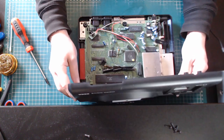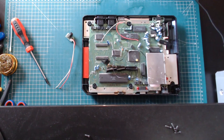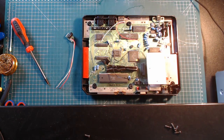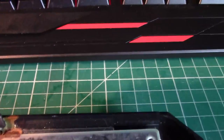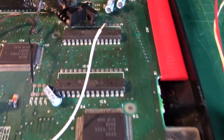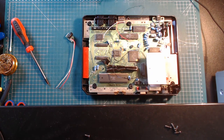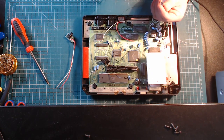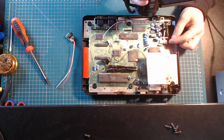Oh dear god. What are these? Let's get some light on it. You can see the cartridge port has had a visitor. There's been a spill in the back here. The whole board is filthy. Someone cut the LED. Switches out. There's a capacitor just floating around here — its legs are back there. There's another crushed capacitor here.